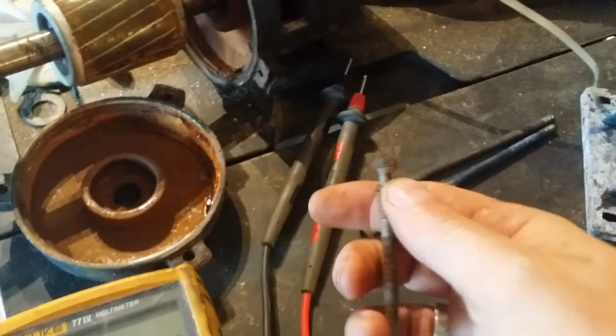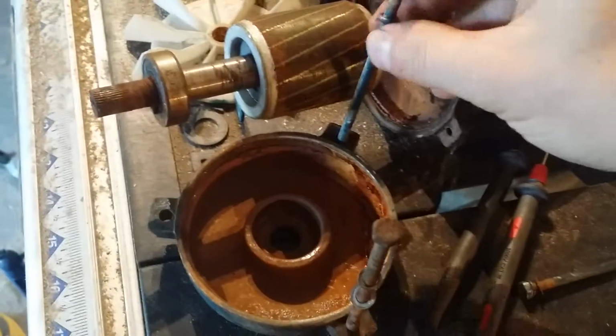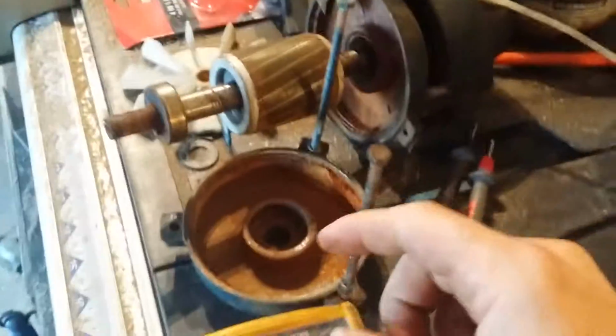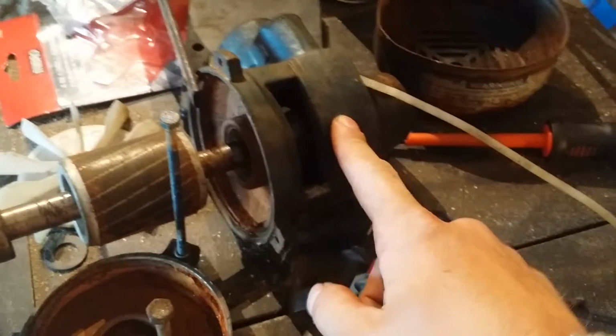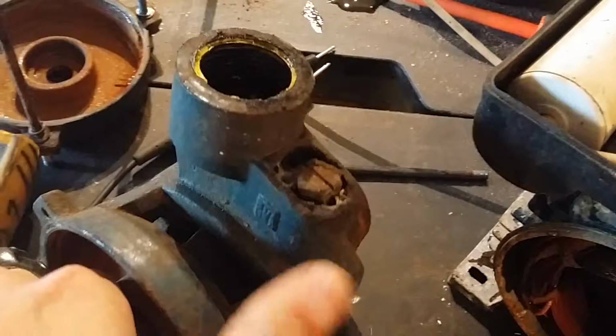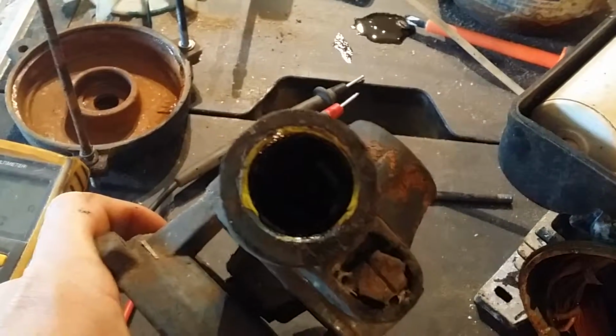How you get this apart, at least this one, luckily, there's these 3 bolts, and they go in these holes, basically, but backwards, because this piece goes inside of here. This is one of the caps, which is also the pump, the actual pump, and this is the other cap, which goes on the other side, and then it spins. Let's take a look inside and show you guys. So this part on the end is the actual impeller, and it's pretty quality, like heavy cast material. I believe this is a pump vent to get any air out. Basically you would open that until fluid issues, and then you don't have any problem with cavitation inside.